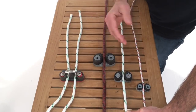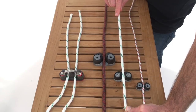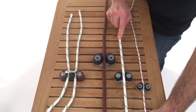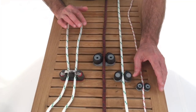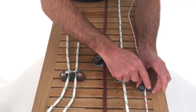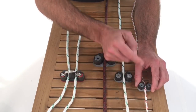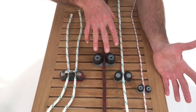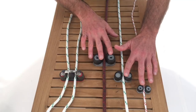When I release it, it stays cleated. To get it back out, all I need to do is take a little bit of the tension and raise it — very fluid action. There are also a number of accessories you can get with these: leads in the front, leads in the back, straps over the top, wedges to change the direction so you can line it up with the load. Check out our post if you want to see all the different accessories for these three different sizes.